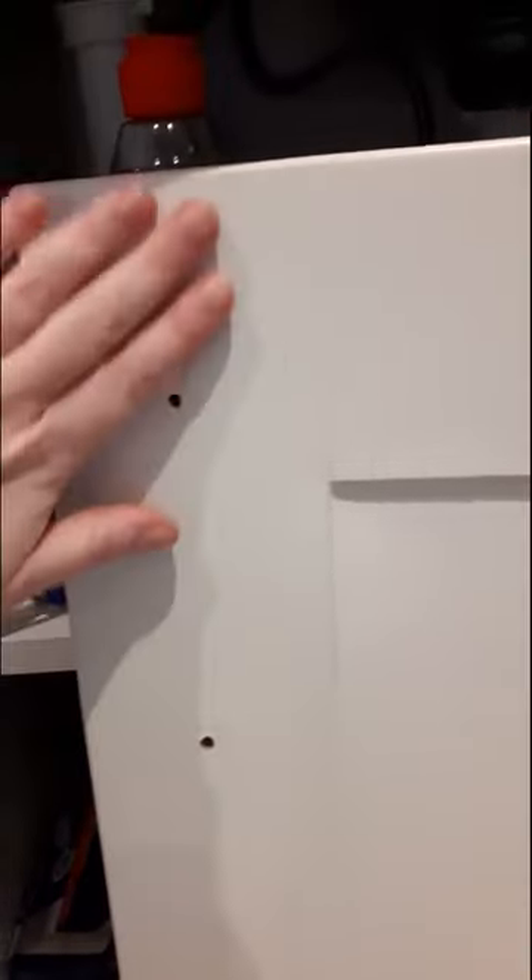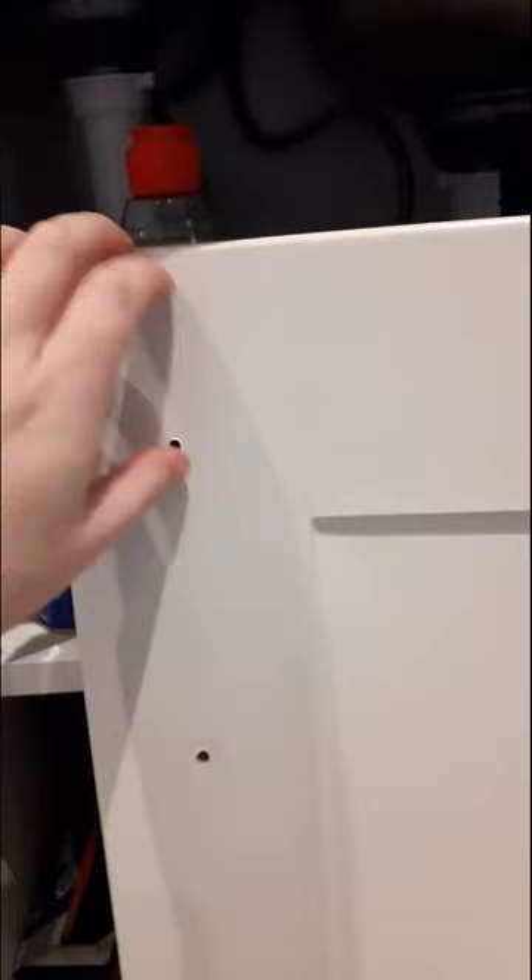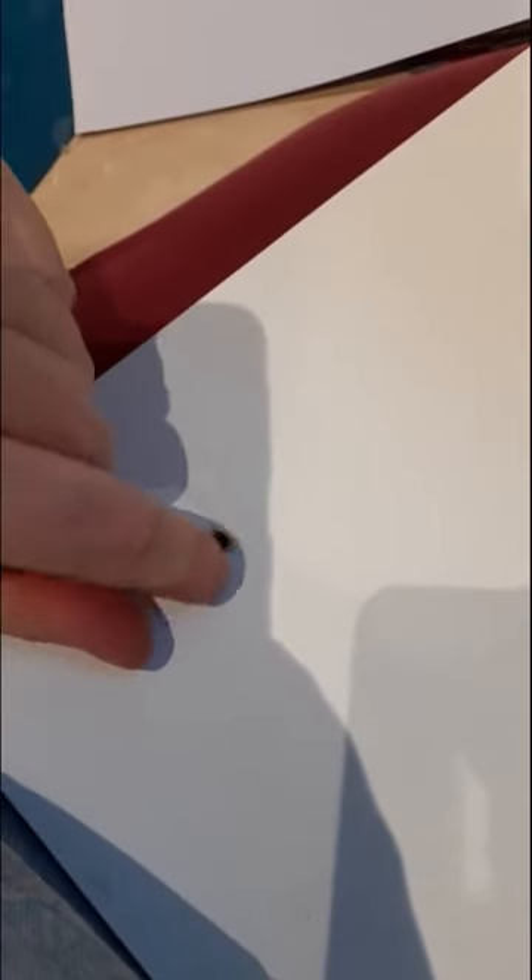When I put this onto the new door I'll do it flat, but I'm going to drill from the front of the door. Because when you drill through, just in case I do take a little bit of the covering off, you want that to be on the inside rather than the outside. This will all get covered by the screw head anyway.